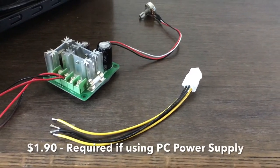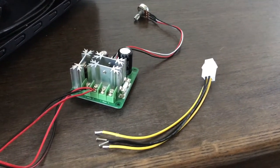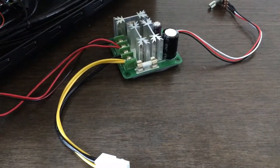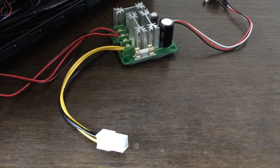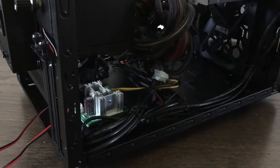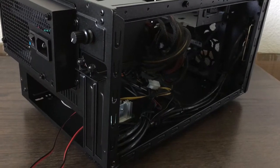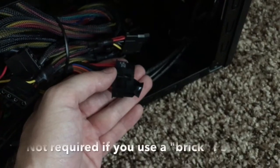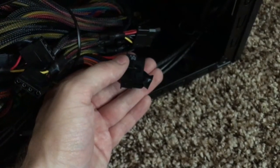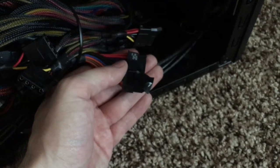Because I'm using a PC power supply, I bought a four-pin extension cable, cut it in half, and used that to tap into the power supply CPU output. From there I placed the motor speed controller in the bottom of the case below the knob. To enable the power supply I had to use the paperclip trick, where you short circuit the green and the black wires on the motherboard connector. Link in the video description on how to do that.